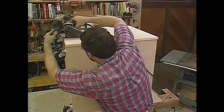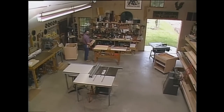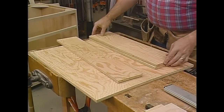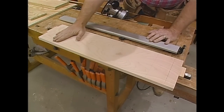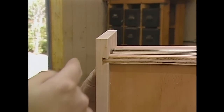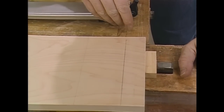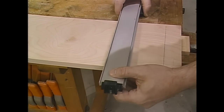Good morning — I've been waiting for you. I want to show you the parts that I've been cutting for the drawer. This is for the back, these two pieces are the sides, and this large piece is for the bottom — they're all half-inch AC plywood. Clamped in the bench vise is another piece of birch for the drawer front that I've edged, and I'm getting ready to cut a dovetail joint. This is a sliding dovetail — the side slides in through the joint, really making it secure. The first thing I have to do is lay out the center of the dovetail cut and put an indicator mark — I don't want to go all the way through and show the dovetail at the top of the drawer.